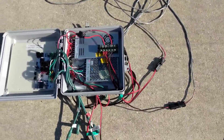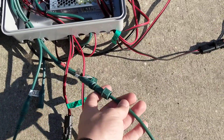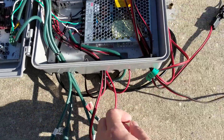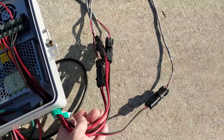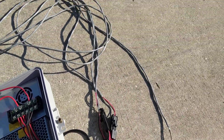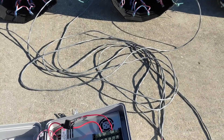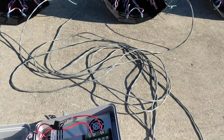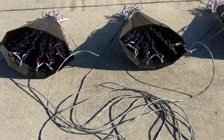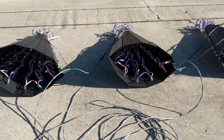You can see them run back to my box here. Here's my one port off the F4 sitting in the lid, and here are my four power injection connections just for those trees. So that's almost 300 pixels total on one port off the F4, and it's only five cables to wire them.